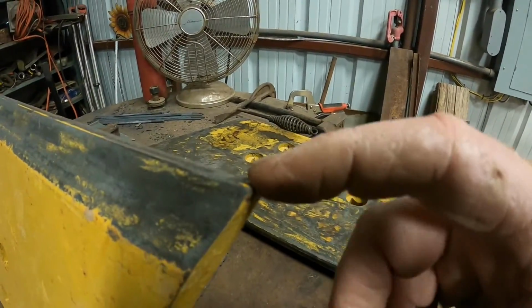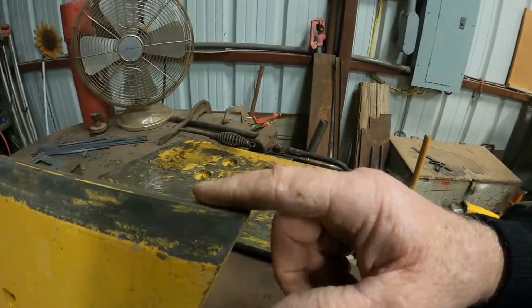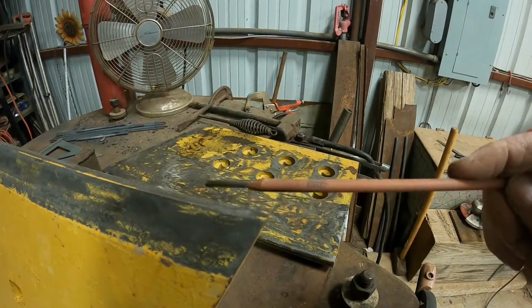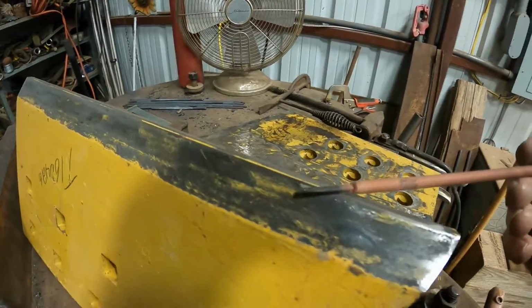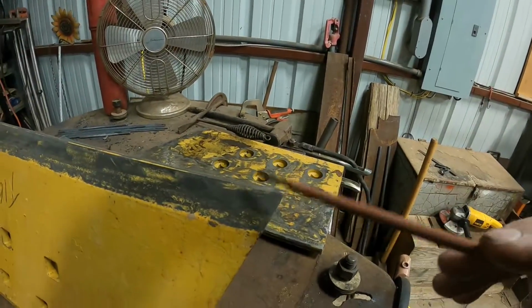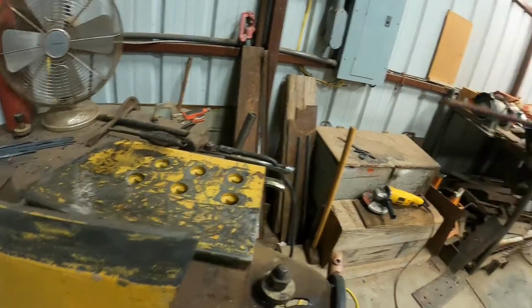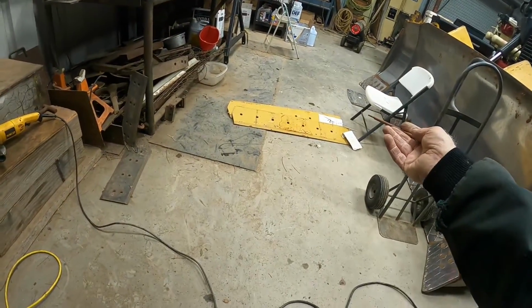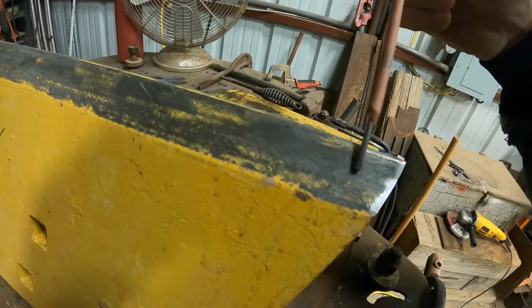These are wider than the cutting edge. This right here is half inch wide to start off with. And these end bits need to be wider. They're what hits the ground first. They're a quarter of an inch wide. So the longer you can protect this end bit from wearing down, the longer you protect your cutting edges. That's why I put some on the back.